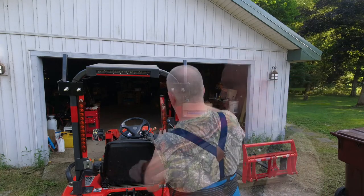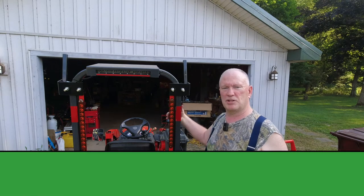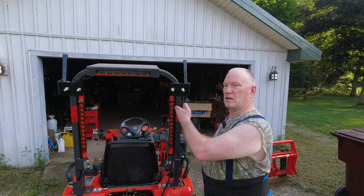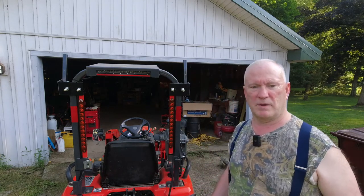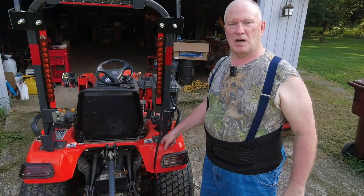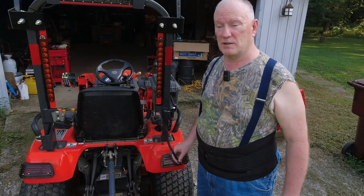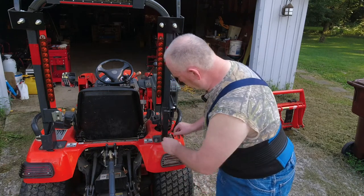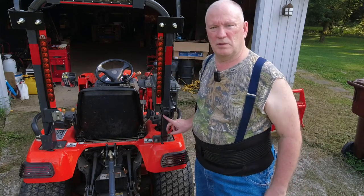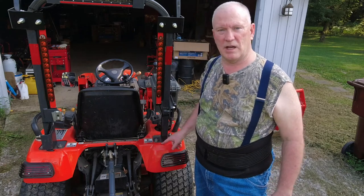I mounted the magnet on one side and the lamp on the other. These could be mounted on either side, but I chose to mount them on the inside, thinking that if a branch came along and tried to peel it off, it would be much more difficult — it would have to poke inside the ROPS to knock the turning signal off. On the 50 series there's a factory hole in the back of the rear fenders — I don't know what it was for, but I found it convenient to route my wires down through there. I used two tie wraps to secure the wire harness to the ROPS and routed the wire harness through that hole in the fenders.